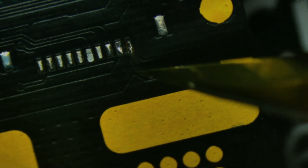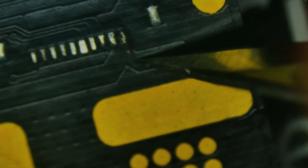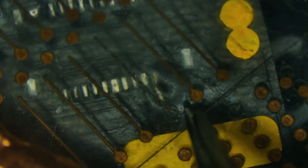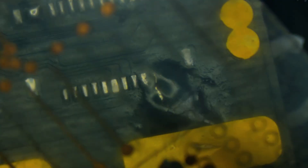I can tell that this pad connects to a larger trace. So I'm going to take a razor blade and carefully scrape off the black top coat to reveal a part of the trace that I can tie into. We'll add some flux, take the soldering iron, and tin up that little exposed trace. I'm going to get out a trace repair kit — I'm out of rectangular ones, but I have circle ones, so I need to find the right size to work with.